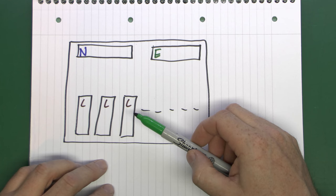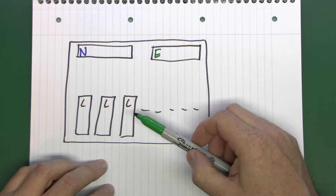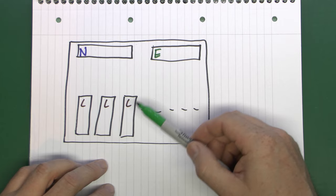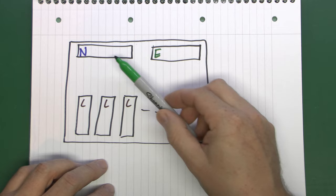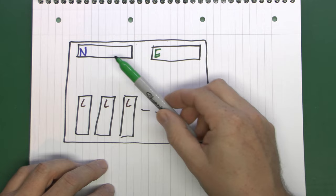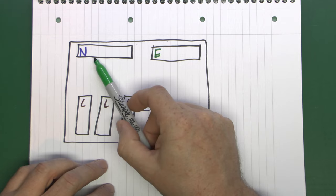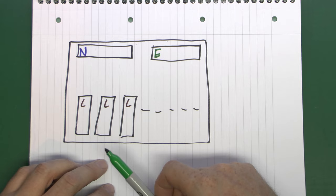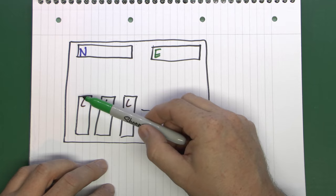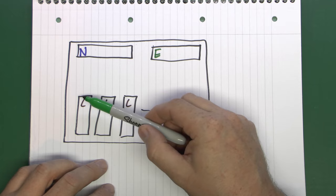In a typical installation you have a consumer unit or fuse box. Inside there you're going to have three wires: the neutral going to the neutral bar, the earth or protective conductors going to an earth bar, and the line conductors connecting to the fuse or circuit breaker. To do insulation resistance testing, it's necessary to disconnect the neutral and line conductors from those locations. Although you could turn off the circuit breaker, it's generally advisable to actually move the wire. If you have an RCBO, you'd have to disconnect the line and neutral from that device, as some can be damaged by applying 500 volts DC.